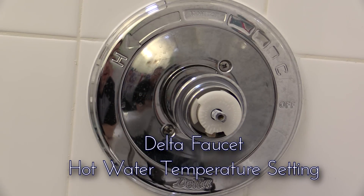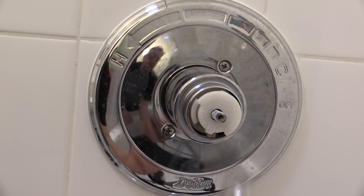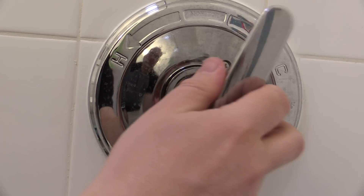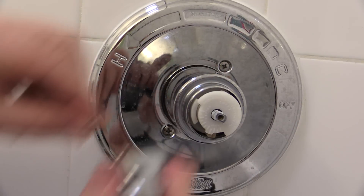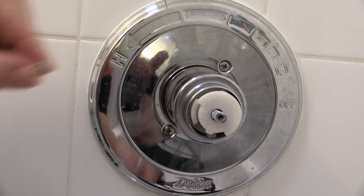It's time to get the kids a bit more hot water in their bathtub. The tub is about 11 years old now and this is the Delta monitor faucet that's on there. I just took the handle off here and that required getting to the set screw area right there, which was a 1/8th Allen key.